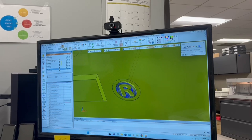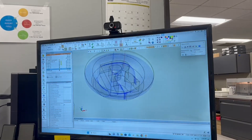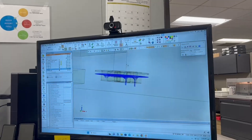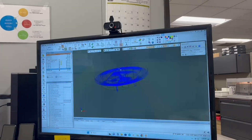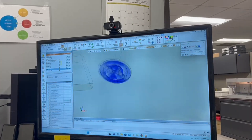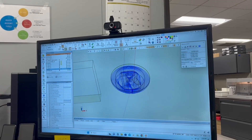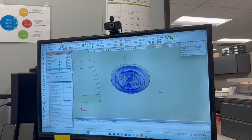To take a look at this tool path — I just waterfalled it over the top of it. I'm going to make it transparent so you can see what it ends up looking like. It barely witnesses — it kind of looks like a bubble letter R. And that's fine for the electrode in this particular case. The reason we're wanting to find another way to do it is because of this type of feature. It may not always be the registered trademark, but other logos that are fancier or more detailed. We can do it now differently with using the laser.